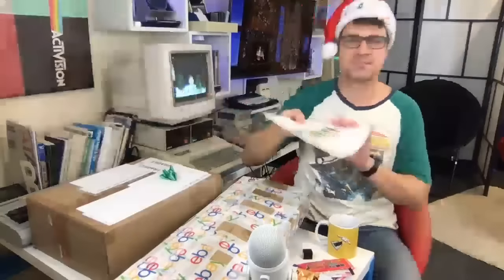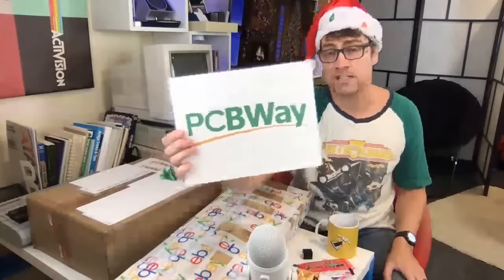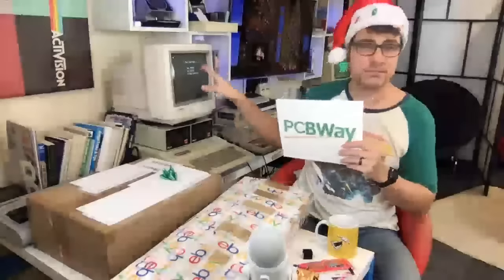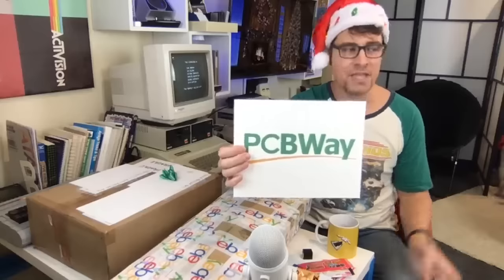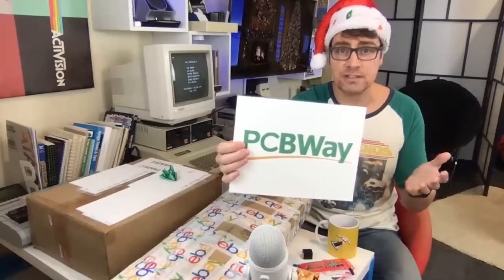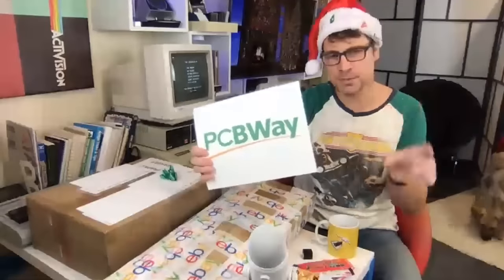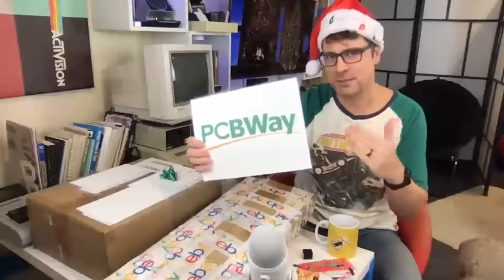Speaking of PCBs, I do want to do a quick shout-out for PCBWay — I mention them a lot on this channel. They've been helping out with an upcoming project. What we're doing is finally giving the Commodore 64 a way to switch between NTSC and PAL. This is an NTSC machine, and the problem with NTSC is the vast majority of games and demos were written for PAL. So the music plays too fast on NTSC, and there are other timing problems. Sam's Journey is a good example — you can't actually play the cartridge on an NTSC machine at all. So with this thing we're building with PCBWay's help, it's going to allow you to put two VIC chips in this new PCB, and with the machine off, flick a switch and it will switch to the other VIC chip.